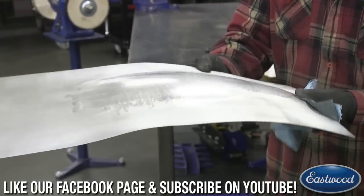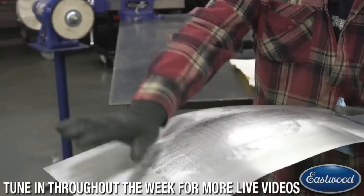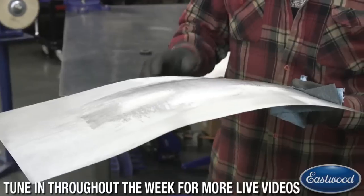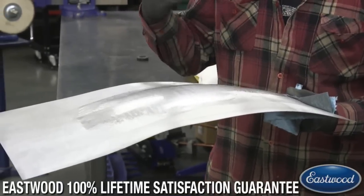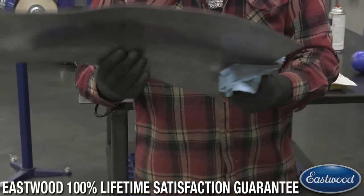So you could see, you know, we did a lot of stretching in here. I even blended out at the end. I started blending it out into here to smooth out. So you can use the hammer. You just got to know how to turn the pressure so that you're not stretching too much. This thing will stretch very quickly, so that can cause a problem.